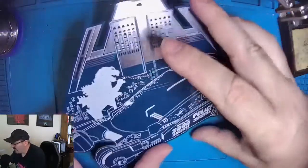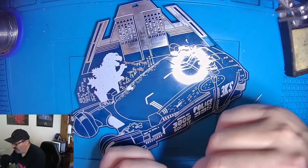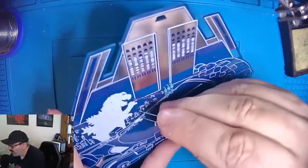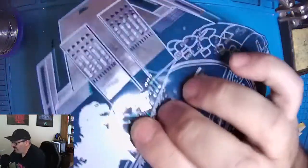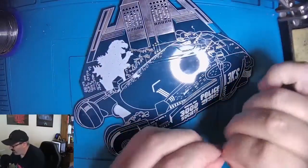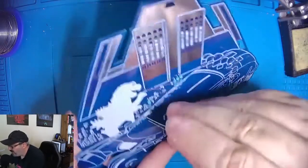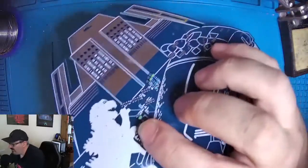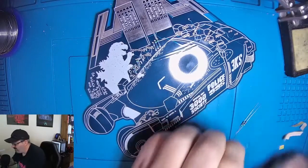One of the unique things about this board from my other designs is that I put in a capacitive touch area to be able to use that instead of a button for changing the LED modes. So we'll see how that works in just a little bit. When we get to working on the trinket, I will show how to put the code on the trinket and how to program it, and what my program that comes with it does. The trinket is programmed with CircuitPython, so the code is Python code.